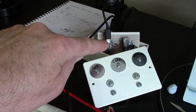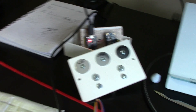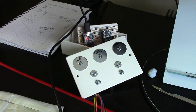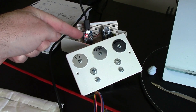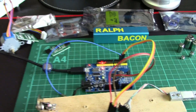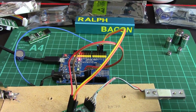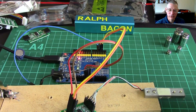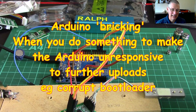Because this is permanently connected and running all the time, what's happened is when I've done a couple of demos I've forgotten that I had another Arduino permanently connected to my machine, chosen the wrong port number, and overwritten the code in here with something designed for the Uno — in fact this very project on my bench now. You might think, well just overwrite it with the correct code. But it's not quite that simple. When the Micro gets overwritten with the wrong code it sort of bricks itself because it's lost its connectivity.